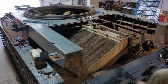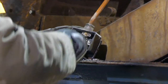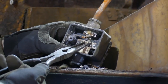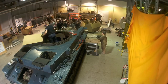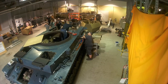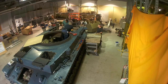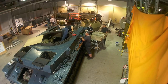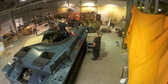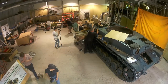We'll be removing and photographing everything beforehand to have a record of it — all the internal fixtures, the electrics, and any devices that are bolted to the hull. They'll all be labeled so we can move those out. We can then get in and actually sandblast the inside and make any repairs to the metalwork and superstructure that have to be repaired. As I said, Rome wasn't built in a day, so we'll just carry on one piece at a time and take it from there.